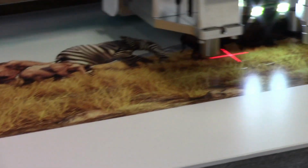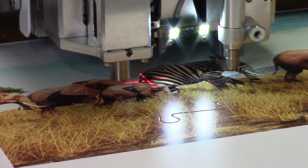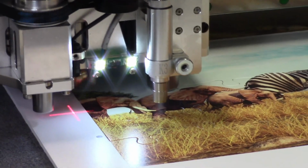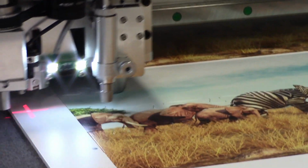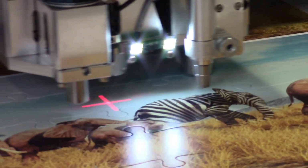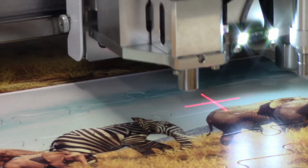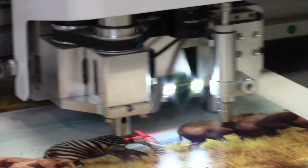While that's doing that, let's just recap on the actual size of the sheet. So 800 by 600 size sheet, okay? Up to 6mm in depth for your material. Up to 1200 millimeters per second in speed. And as we showed you in the PowerPoint presentation, the software allows us to reduce the speed for different complexities of the machine automatically through a material database.